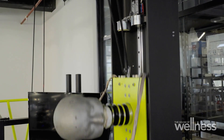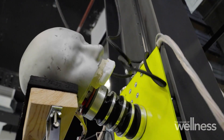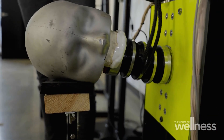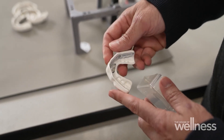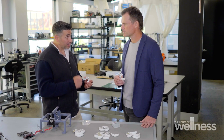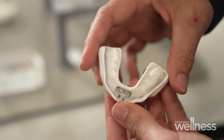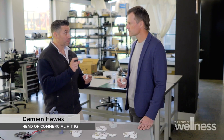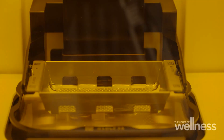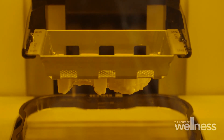That looks nasty. I've seen plenty of knocks in footy, but witnessing a hit to the head like this is confronting. Is that a fair amount of impact on the brain that we've just witnessed? Absolutely. Dan, can you explain how the HitIQ mouth guard is able to monitor and track head knocks? So we've taken the normal custom fit mouth guard and put a circuitry board inside it. On that circuitry board, we have micro sensors that measure forces. Every time you get a head impact, our system is measuring that head impact at 15,000 times per second, providing very accurate data measurement. Fitted and calibrated to individual players, the impact sensors log all head knocks and highlight an athlete at risk of concussion.